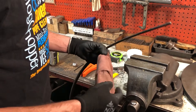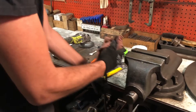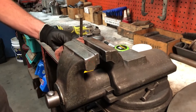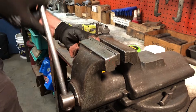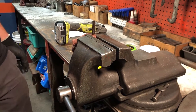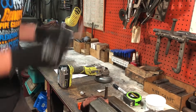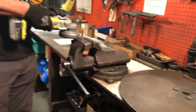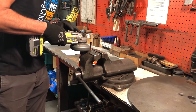In order to cut the shaft, put a rag around the shaft and clamp it in a vise. Make sure the shaft isn't sticking up too much so that it doesn't wiggle when you make the cut. Make sure you have safety glasses. Then use your abrasive cutoff wheel, going perpendicular to the shaft, and cut right through.